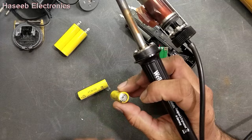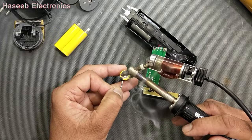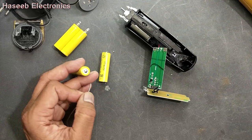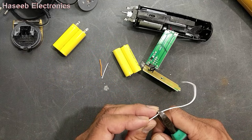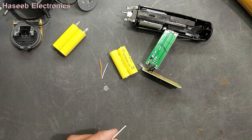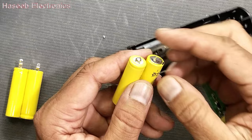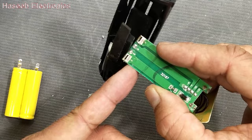Now we will make tinning for both batteries, and then we will make the jumper. I will cut two wires for positive and negative and make one piece. We will make a jumper on this side and take two wires from here and connect it here. Now I have connected the jumpers. So this positive end we will connect to the board positive side, and negative to negative.